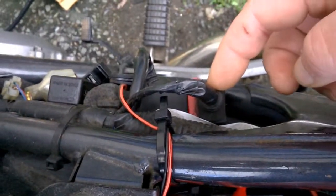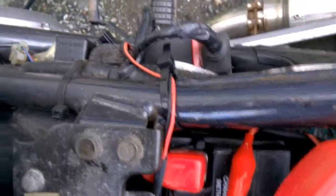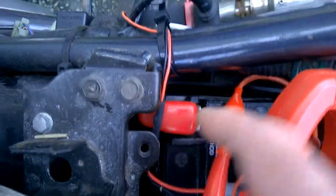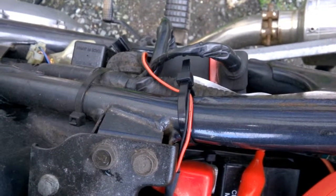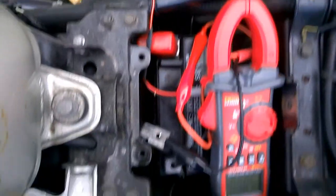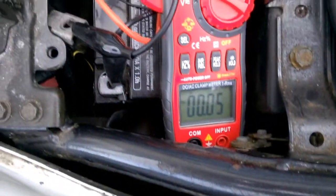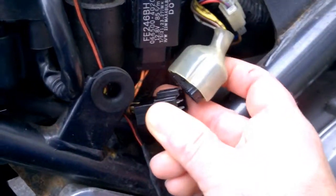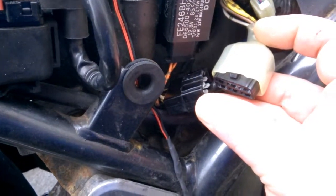The fault goes through the starter relay, but it's not the relay itself. It's the positive going from there — white wire — through a fuse and into the ignition, and it also goes into the rectifier, which is going to be my next problem. Same setup: jumper cables, clamp meter — no draw. Let's go around this side. I'll pause for a second and show you the meter when this is reconnected.